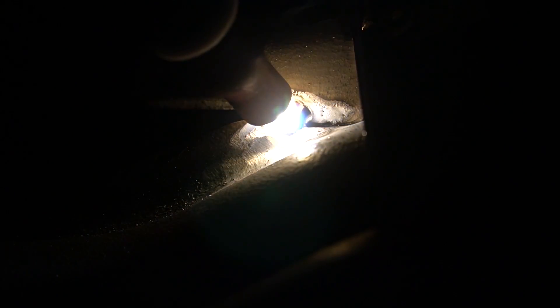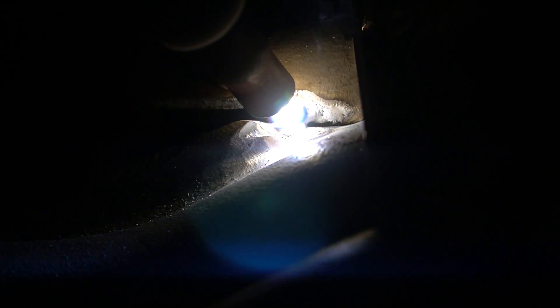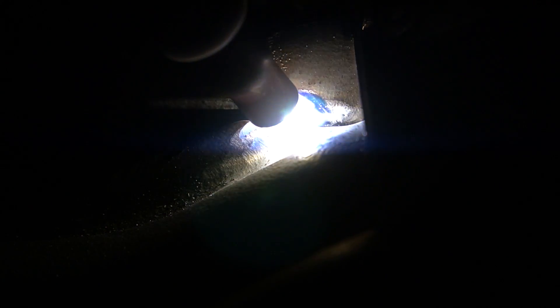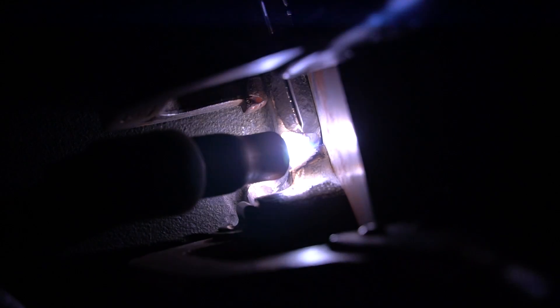As we start digging into this thing, you can see all kinds of junk just start floating up. What I'm basically doing is moving the torch around and just letting it break out some of that crap, getting some of that good metal. As I hammer down on it, I'm just going to deposit just a little bit of metal on here after I clean it all out — just a couple little dabs, then hammer down on it. The reason I'm doing this is I'm trying to force all of the impurities out of there where it will solidify with some good clean metal. So it's little dabs hammer down, little dabs hammer down, just try to blend this in until I stop seeing impurities — less porosity, less holes, less junk coming up to the top.